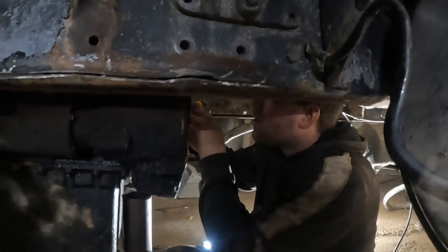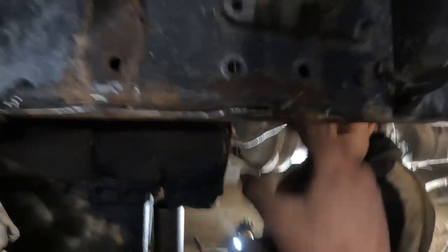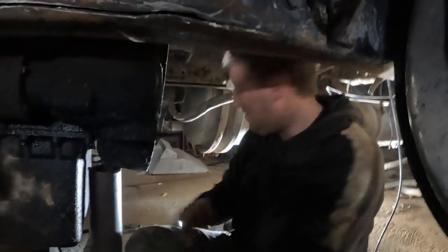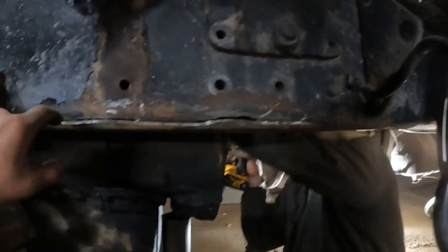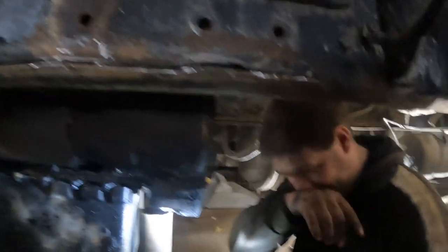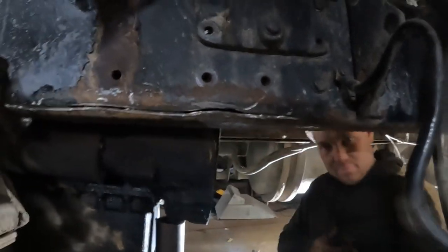The problem we have with double frames - we take an air hammer, I already cleaned it up. I knocked all the steel out, got it all flush so you can actually see through it now. You grind into it till you're all the way through, and then you 100% weld that thing so it's pure weld and it's good. Then you go through with a sanding wheel and that way nobody really sees it.